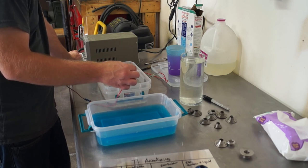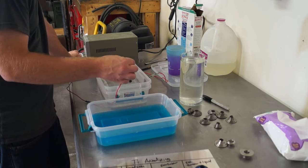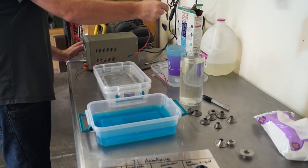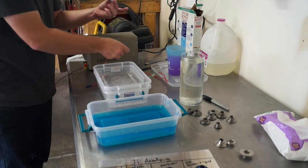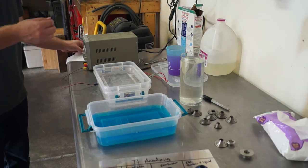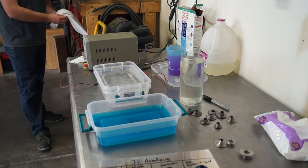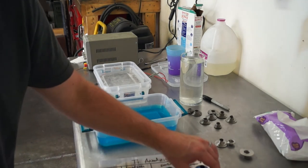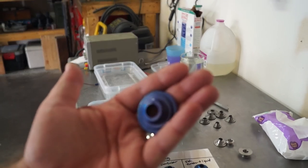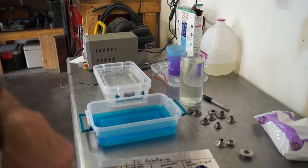Let's run it again. Yeah, I like that a lot. I'm going to stop this at purple to show you the difference in colors — it's somewhat of a bluish purple. This is not the right way to do it — you want to stop at the right voltages and not pull it out midway, because you get a rainbow effect. But man, it looks good. I'm going to take these outside so you can actually see them, and leave them in the order we did them.